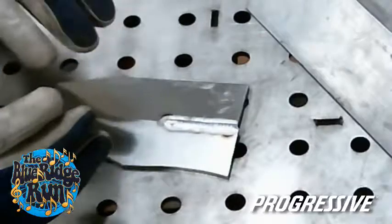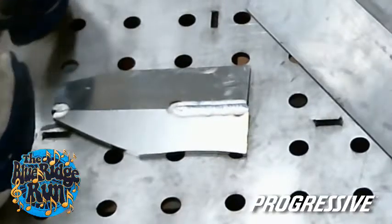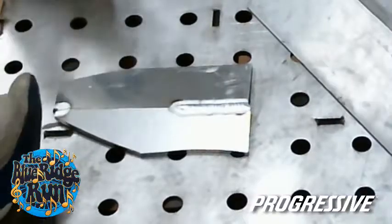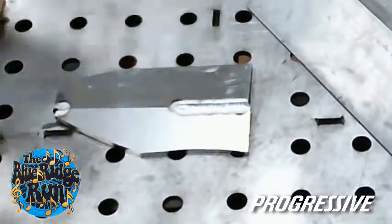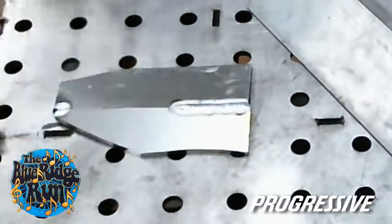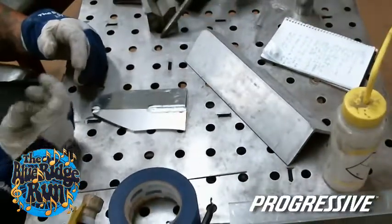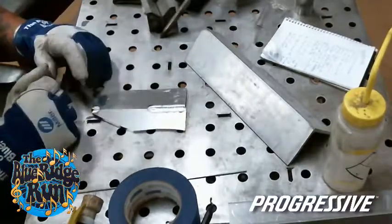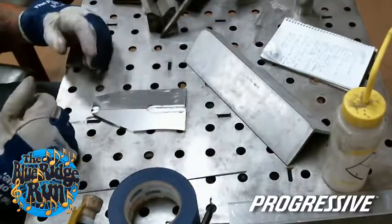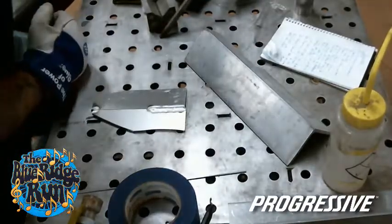It's wider, it's bigger, a lot more material. A lot more material is drawn in, and that goes for everything, contaminants and everything else. Not that it's okay, but especially with mild steel, that heat will want to blow things out. With aluminum, it's drawing that extra material in, and it's also drawing in all the extra contaminants. So it's a lot more finicky. Like we said earlier, exotic metals like titanium are far more vulnerable to the things in the environment and atmosphere than welding steel or even stainless sometimes.